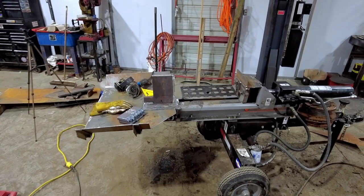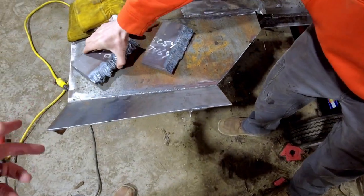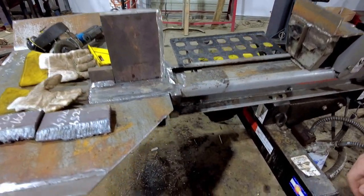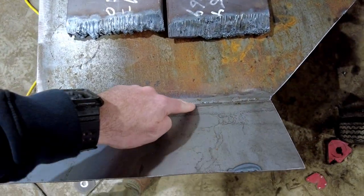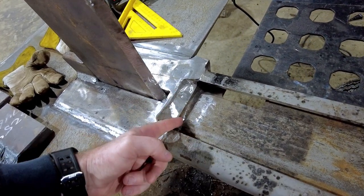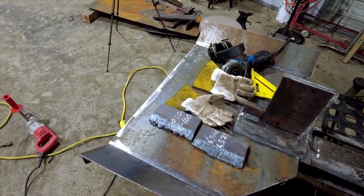So this is where we stand. George is back for our final night. The only things we have left — grind these down, they're still a little warm. These are going to be the wings on the four-way. I did drill a bigger hole to put a bolt through it. I also did some welds and ground this down so now it acts like a ramp — if a piece of wood comes in here, it used to be flat, so now the wood will ride up and head into the wedge.